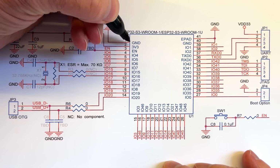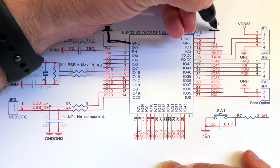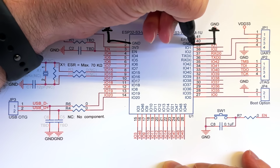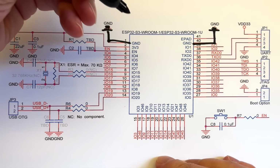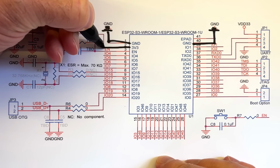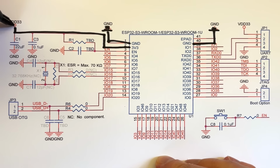required. So obviously, something we definitely can't do without is a ground connection. There are annoyingly 2 ground pins. We could probably just connect one, but we'll do both for now. We're also going to need 3.3 volts. Unfortunately for this, we will need an external component, a low dropout regulator.